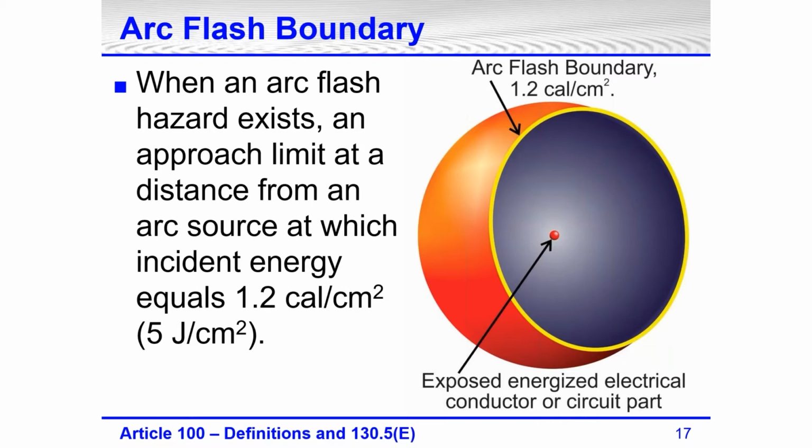The farthest arc flash boundary I have ever seen was just a couple of months ago, at just over 235 feet. The company didn't use, or they were told not to use for this particular project, the 2 second cutoff rule. So it had an incredibly high incident energy and an incredibly far arc flash boundary, over 235 feet away. The closest arc flash boundary I ever saw was last week in Norwalk, Connecticut. I was up there for 3 days of training, and the closest I've ever seen was 2 inches. Before that, I think I had seen a 3 or 4 inch arc flash boundary. So they're all over the board as far as close or far.